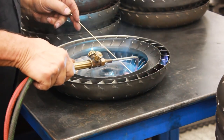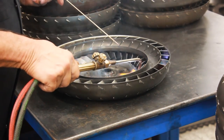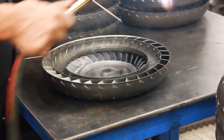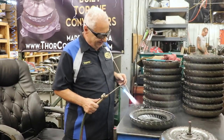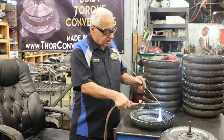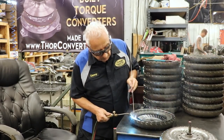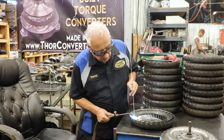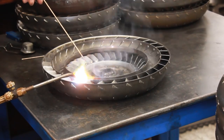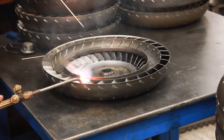That's the whole bottom row coming up, all brazed up. Then once I get all of these brazed, I'll go to the upper blades — the upper blades are a little bit different. I'll get the bronze in the corner and then go in a circular motion and walk it right down.